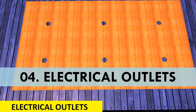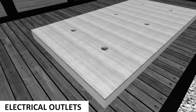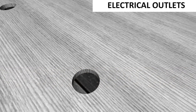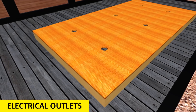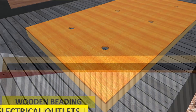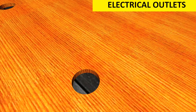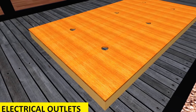Number three: mark out all the outlets for the ceiling lights and switches. If you want the ceiling modules painted, turn the module over and paint it with a white undercoat followed by a final white coat. White paint is good for the ceiling since it increases the amount of reflected light, making the container appear lighter and brighter. Alternatively, attach a black wooden bead onto the side of the box frame, slightly recessed from the ceiling surface, to act as a visual barrier and connector between subsequent modules, introducing a design statement while saving on painting costs.